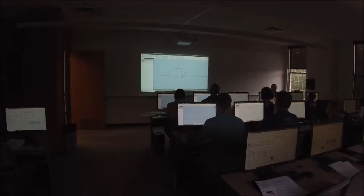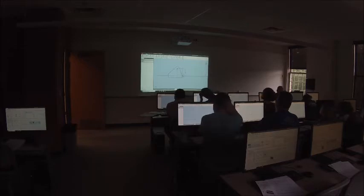Now, this can be a little more work, but the reason that I do this is because it's visual. I see that dotted line running across there, and I know that those are straight across from each other. If there was a horizontal constraint on there, you wouldn't be able to see it. So if I come back in a week and I need to edit this part and I don't remember what's going on here, I see that dotted line and I know what's going on. And it's easier to delete this dotted line if I don't want these two points to be horizontal from each other in the future. Say something changes and I need to change something on the part and I don't want them to be horizontal anymore. It's easier to delete that line than it is to go in and delete a constraint. So that's why I do it this way. Once again, though, this is a personal preference thing. Just find a way that makes sense and works for you and just do it.